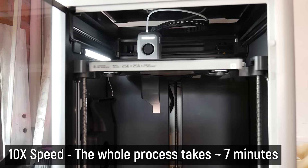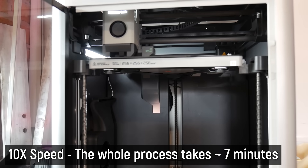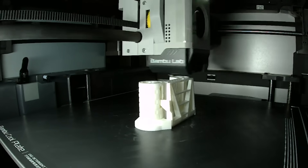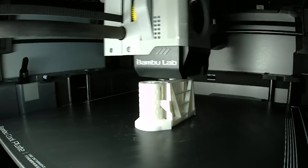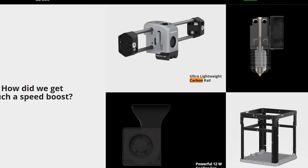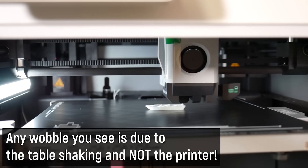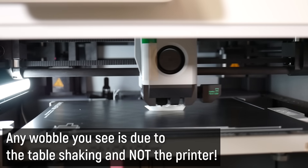Now this cleverness is fantastic, but it actually slows down how quickly your print will start — with the machine spending several minutes after preheating doing all of its checks and LiDAR calibration. But once it does start printing, boy does it smash out prints. Its ability to print this fast is in part due to the fact the X1 Carbon actually uses carbon fiber tubes for the x-axis linear bearings. By using lightweight carbon fiber rods instead of heavier steel rods, they can reduce the inertia of the print head drastically and squeeze even more speed out of an already very rigid XY gantry assembly.